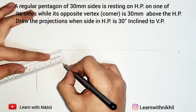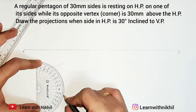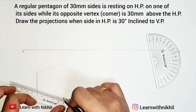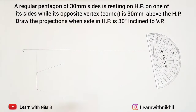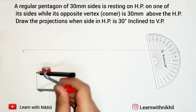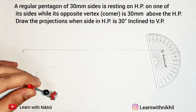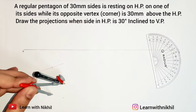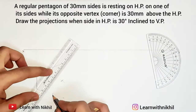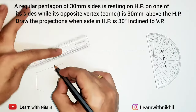From this end also I will take an angle of 108 degrees and mark a point, then draw a line from here also. To mark a pentagon with side 30 millimeters, on the compass I will take a distance of 30 millimeters. Keep it on this end and cut an arc; from this end cut an arc as well. To make a regular pentagon all sides should be 30 millimeters. From this end cut an arc at the center, then intersect the arc from this end. Now join these lines dark and our pentagon is ready — a regular pentagon with all sides equal at 30 millimeters.